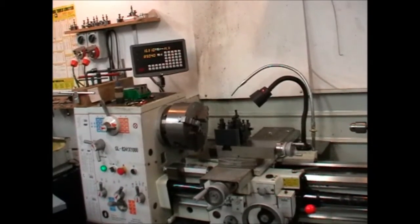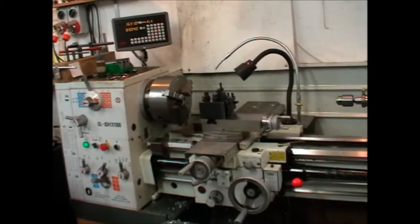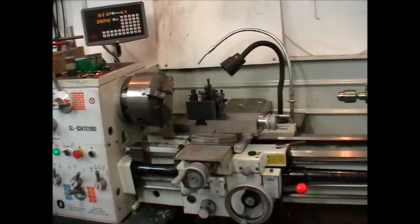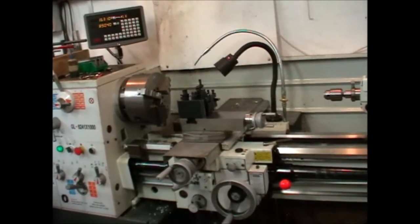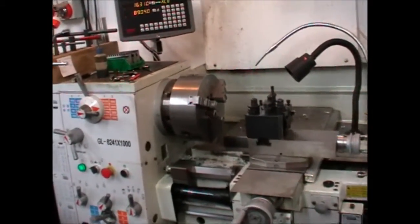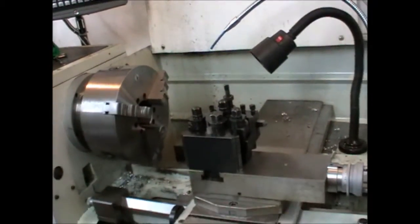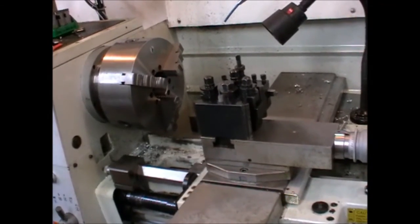Just a final footnote. I wanted to talk briefly about production machining of turned parts with a manual lathe versus a CNC lathe. People tend to fall into two camps — either CNC or manual — and will promote their own particular technology. But in reality, the modern manual lathe is a very fast way of producing parts for low volumes, because the setup is so fast. You can set a modern manual lathe with tool allocation DRO, a quick change tool post, and a set of already formatted tools very quickly. You can plug from tool to tool and machine one or two parts from a drawing more quickly than you can on a CNC lathe.